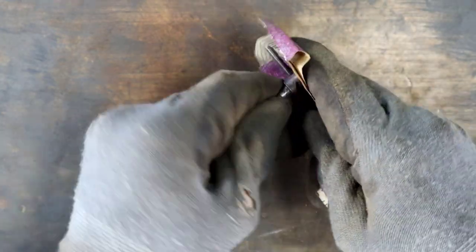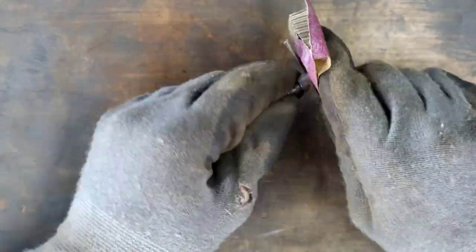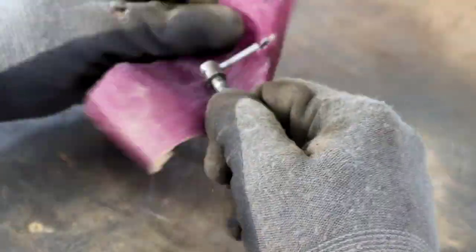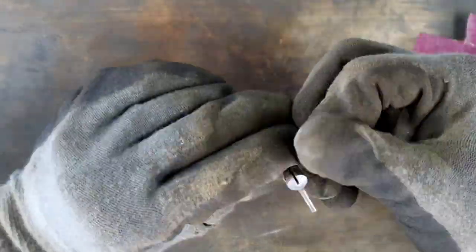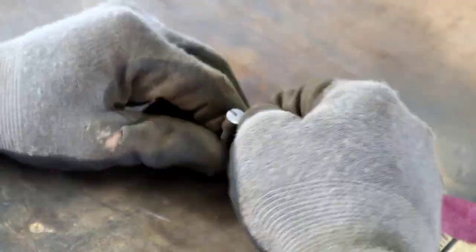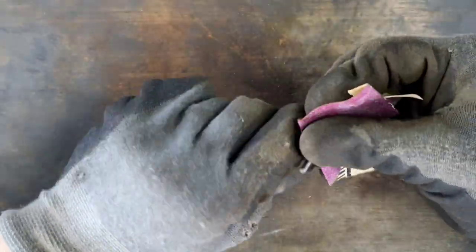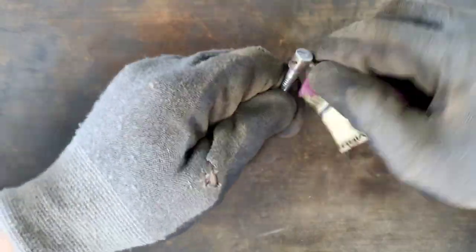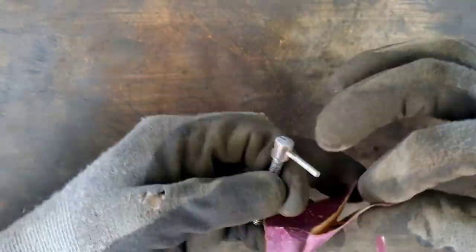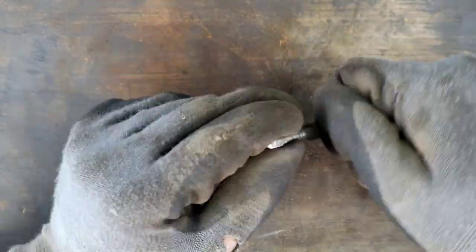While that's drying, I started work on the arm. This is a great time to do a quality check on the threads and get them back to new. Start with the pitch gauge to take out the guessing work for which size to use. These threads are in great shape, so the focus was on the sanding for this project. The rounded knob and the dome top are susceptible to squaring, but you can easily avoid this by rotating the parts you sand to prevent flattening it in one spot. To get into the tight corners, I recommend folding the paper to create a straight edge — you'll need to do this repeatedly though, because it's only going to last four to five strokes before the paper edge is gone. I finished with the buffing wheel after the 220 grit just to take out the fine scratches, using only the firm pad because we were not going for that mirrored look.